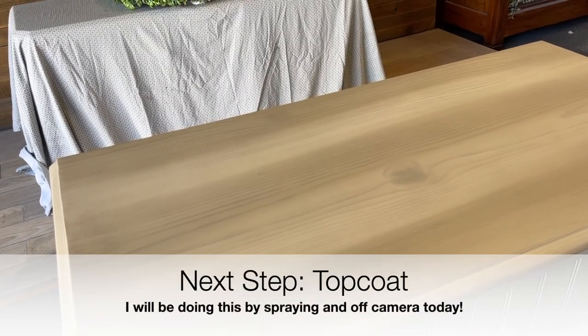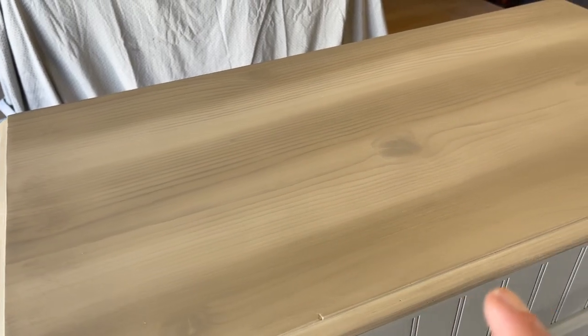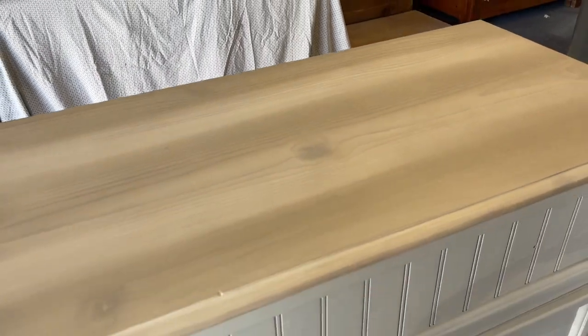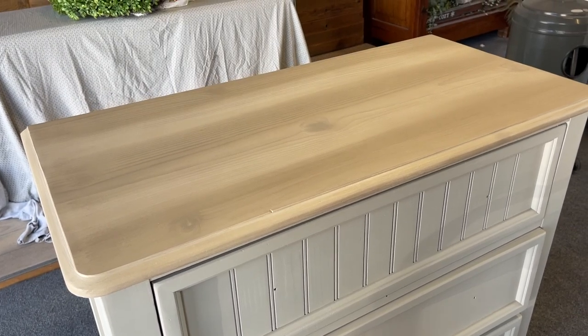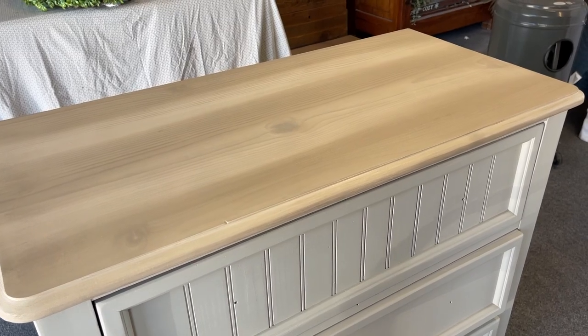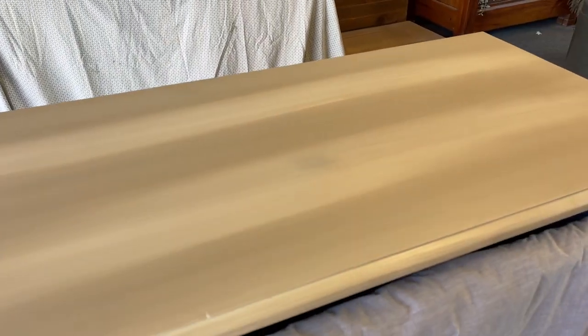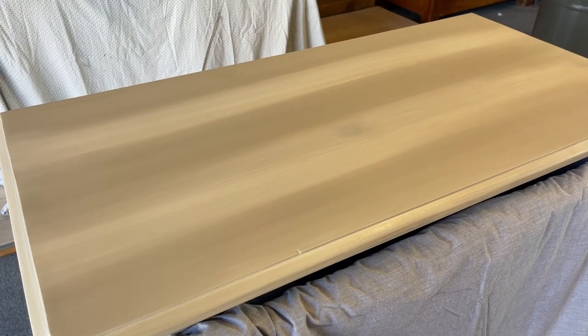I'm going to stop here — I love the way it looks. I love that you can see the wood grain underneath, but it hid the imperfections and inconsistencies and still gives a really beautiful effect. So that is done. I'll top coat that top, but not for a while — I'm going to let it dry for about one to two hours first. This is the first coat of top coat on — it's hard to see the sheen but it's there. It's a satin sheen and it's really beautiful. I'll put on two more coats for a total of three.